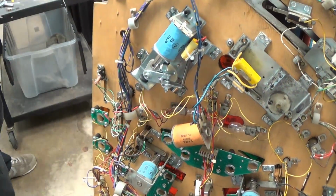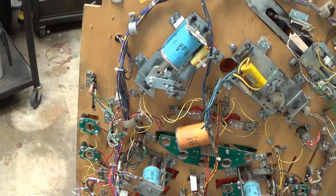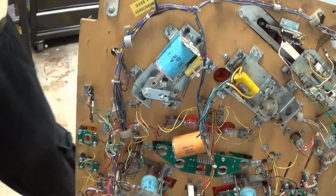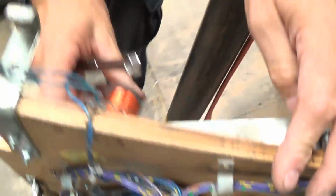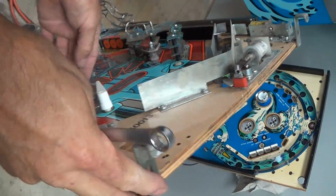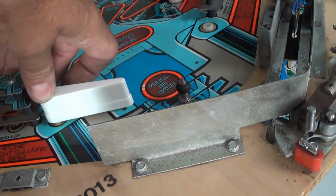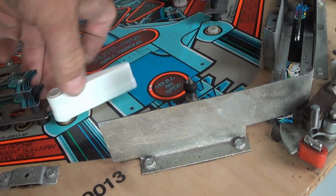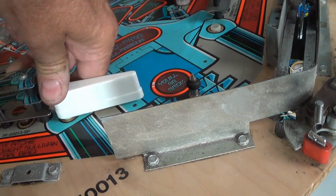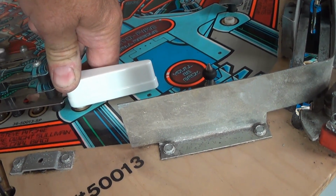We're just going to put this on to show you the rest of what you do here, because this playfield on this end is not ready. Yeah, we'll be obviously taking everything off of there. From the step here, you want to set your flipper angle based on the in-lane guide, and that's where you set it. These guide pegs can be a rough guide. They should line up with the end of the rubber, and then that'll give you a straight down here.